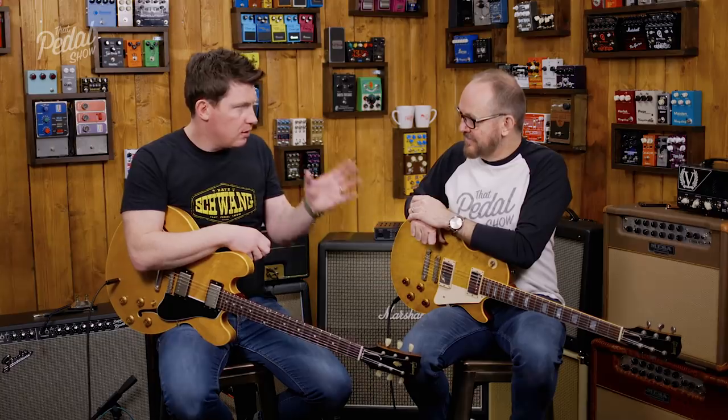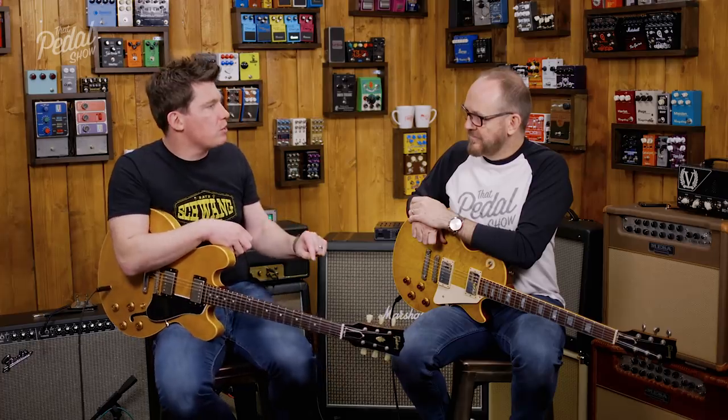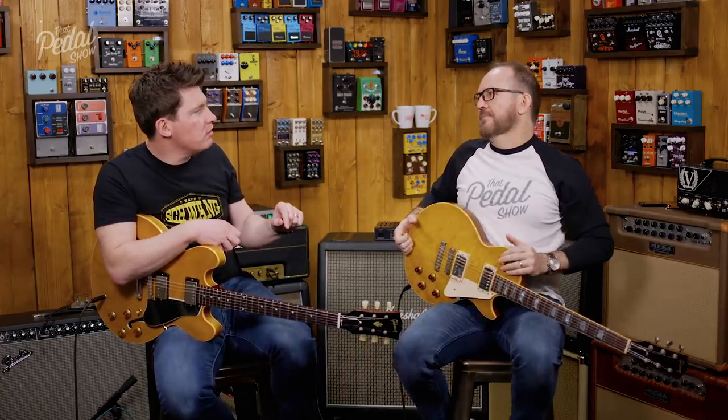However, when we added a buffer in front of the fuzz, as if another pedal was bypassed and giving it a buffer, that's where all the problems started. So when you're talking about buffers from other pedals and the buffer in the wah, they are two different things. That's right. That's been a revelation for me today. Okay. That's what I've learned.